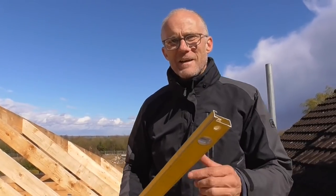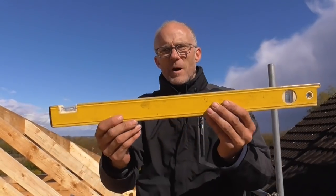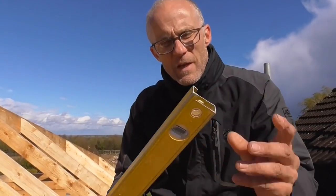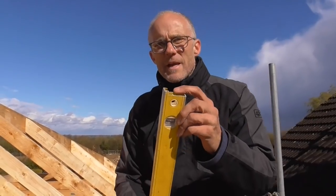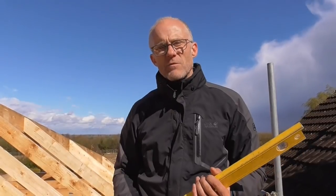What I'm going to show you today is just something a couple of people asked me about — why I've got this section cut out at the end of this level here. This is part of an old 1200 level and I've modified it specifically to help me when I'm putting my soffit and fascias on. What I do specifically is put a sub fascia round first, set that exactly the right height, and then the soffit sits on top of the external skin — the blockwork usually, or brickwork depending on the building construction — and then the outer edge of that soffit I pin to the sub fascia. It's all a result of trying to find ways to make jobs easier when you work on your own like I do a lot.